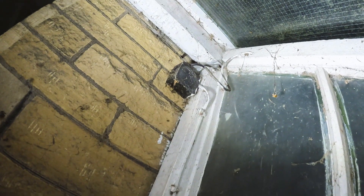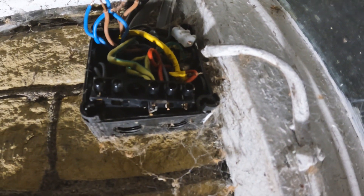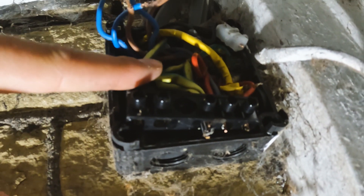Everything's dead over in the garage section so we can ignore that bit. Next little job is just to split the circuit - if we split it we'll have a good half and a bad half. Here's the junction box with all the outside lights. What we're going to do is get the feed in, disconnect it, and test on the feed out. If the issue is going out to the lights it'll be clear in there; if the problem is with the internal side, hopefully it is these outside lights. Testing earth to line and neutral - getting greater than 100 - so something in that box, when I've disconnected it, has caused these cables to clear, which is brilliant.